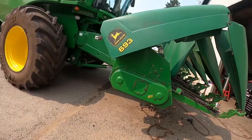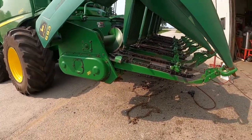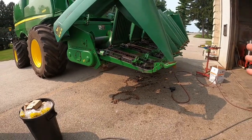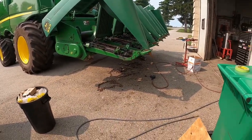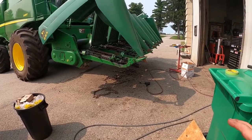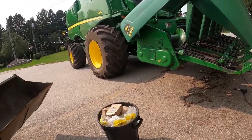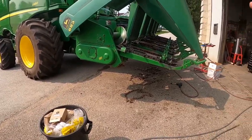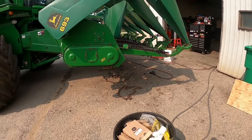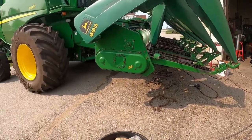So this head is 1998-ish — a 693. We've had it for a lot of years now and it's been a great head. Simple maintenance like this and these heads will go a long, long time. We've put a lot of acres through this baby with no problems. Why do we have a six-row opposed to a twelve or an eight? It just works for what we're doing — we have a twelve-row planter so the six-row head works. In our area we've got a lot of pie shapes and a twelve-row head just doesn't work out well. Plus, when you see us in harvest, the six-row is a great flow for what we have. We're using wagons to take our grain away from the field, so with the six-row head and our buggy, nobody stops all day. It's a really nice flow. Not to mention, this head is paid for — that is a big deal.